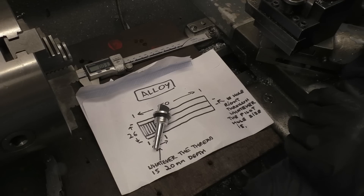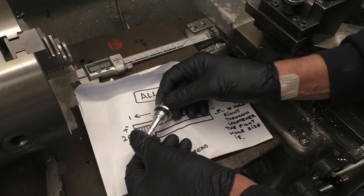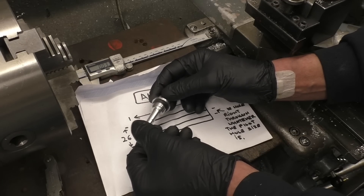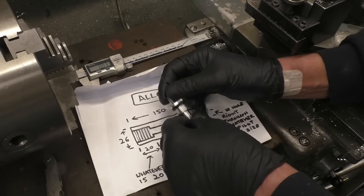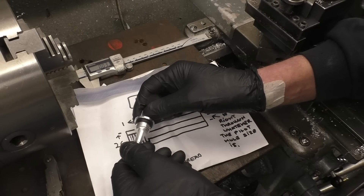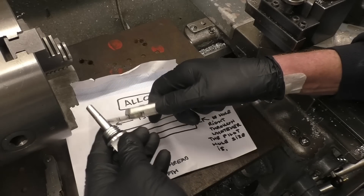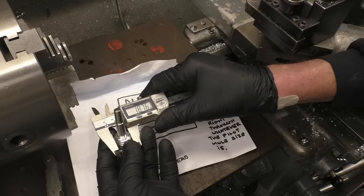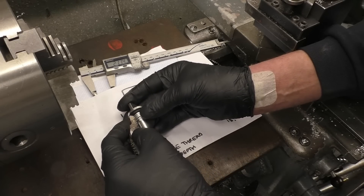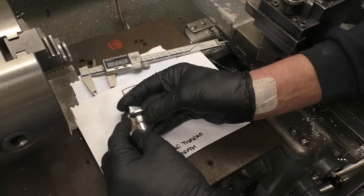What I've got to do is a nice aluminum turning job. A lad makes modified sumps for modified car engines, race engines, and he's going to make a dipstick adapter for a sump. He's bought this off the internet — quite a nice sort of thing it is. I've got to make a simple tube with some threads in to adapt that, and he's going to weld this into the sump. The thread looks like UNC — it's American so it probably is. So if I measure the outside diameter, it's just under three quarter inch. And the thread pitch is ten TPI, so that is three quarter UNC.